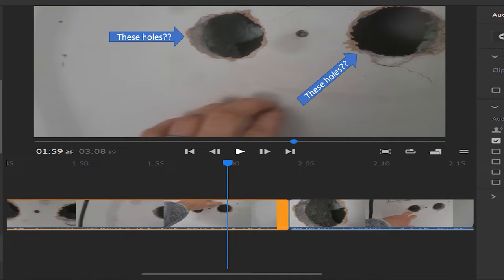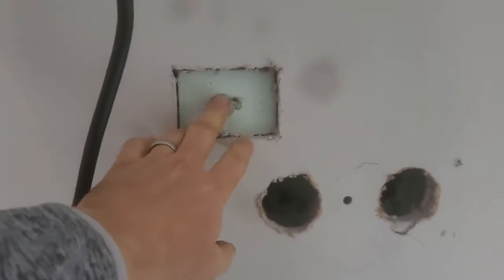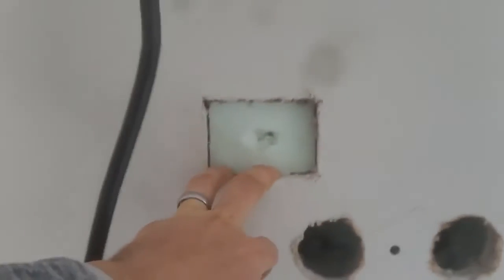One thing I want to stop and talk about are these existing holes. The cabinet guy core drilled this hole and this hole, planning to stick a piece of two-by-four behind it to support his cabinets since they didn't break on a stud. But the wire I had to repair was three inches inside the wall — so take this as a learning lesson: once you get through the drywall, stop drilling. There was no reason for his drill bit to breach the drywall that far. It could have saved this cabinet company about $180 that I had to charge the customer. Also interesting: this is not a normal wall — it's inside a wine cellar, sprayed with special closed-cell foam to keep it cool.